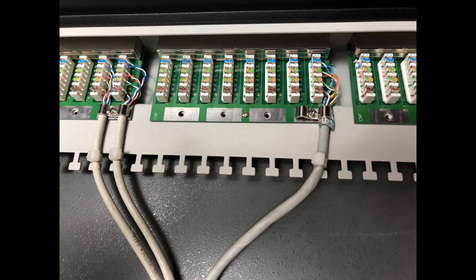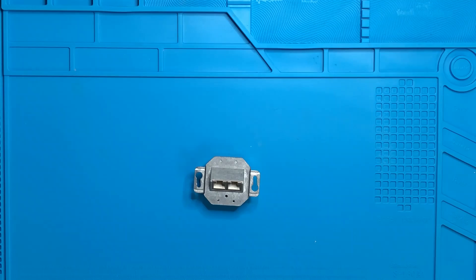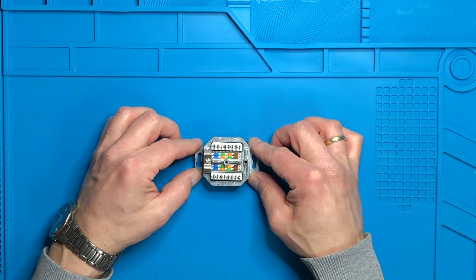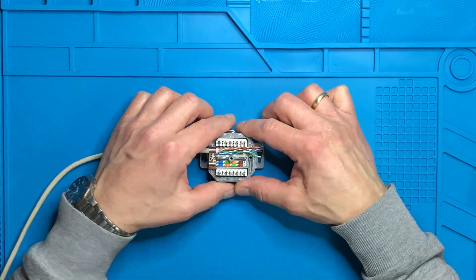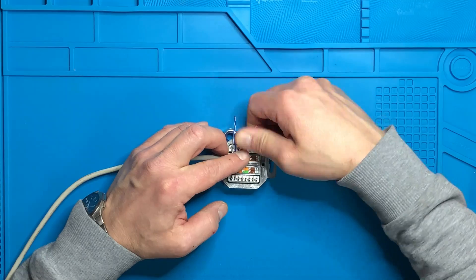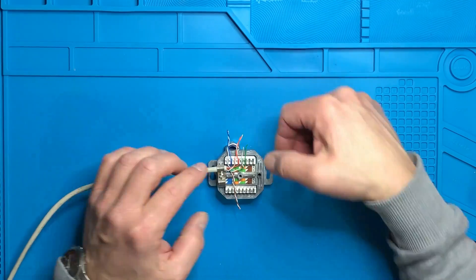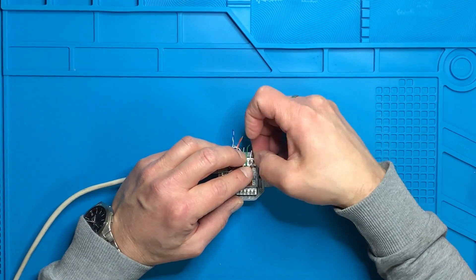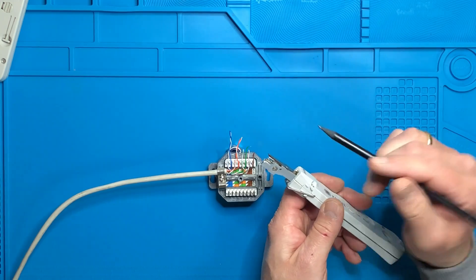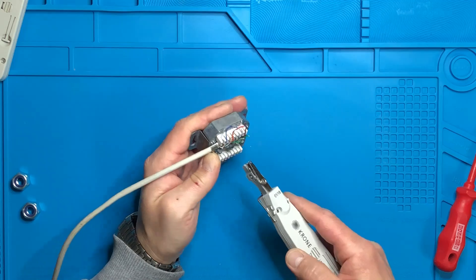This is a view of the patch panel once it's mounted, from the back. With my mock environment I can easily show the back which you would normally not see in a rack. How are we going to connect other rooms and other access points on other floors? It's pretty much the same type of connector with keystones, and there are various types available. Some come with a little plastic tool to push the cables in, or you might use one that has two connectors. Another tip: always run an extra cable — always run two cables instead of one. It's not more work to run two cables than one, so it's always good to have a spare.